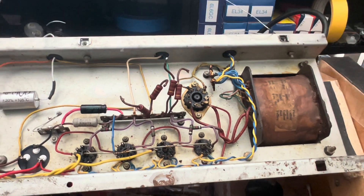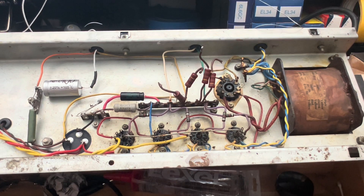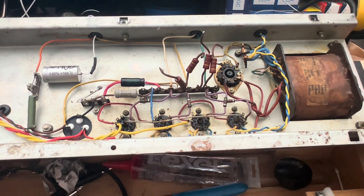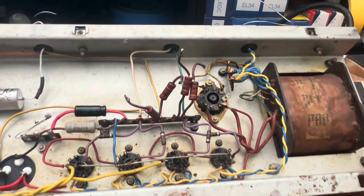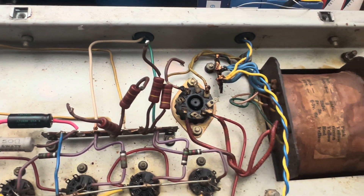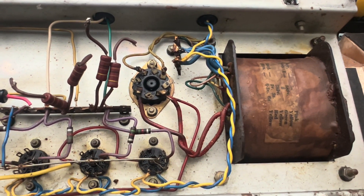Obviously this chassis is oriented in a different direction so you can't see it. But you can actually combine a couple of different taps and then connect that with the other end of the switch — the zero volt tap — and essentially create a 130-volt setting, which will put this thing right in the sweet spot.